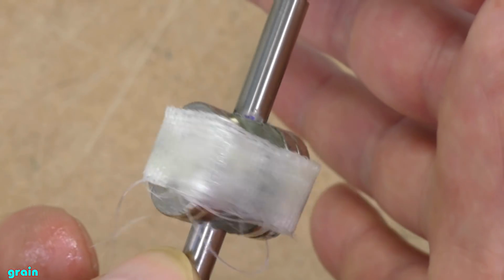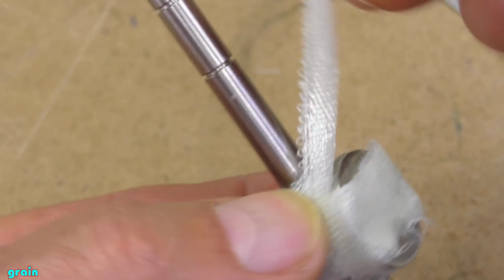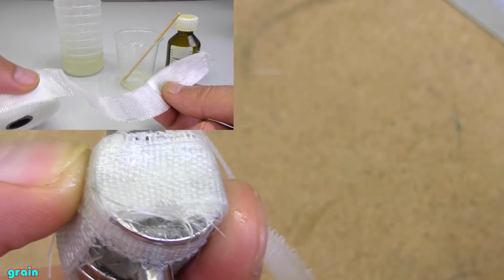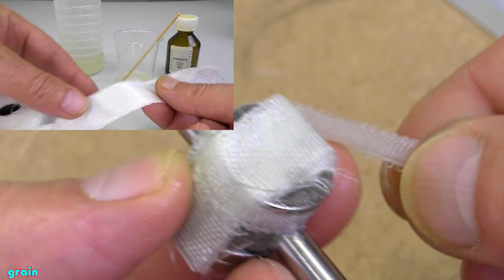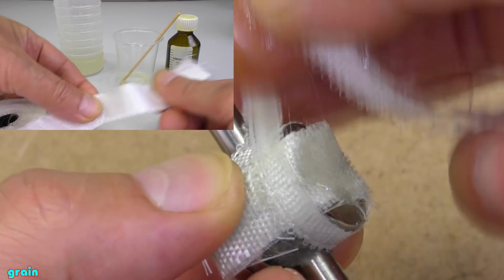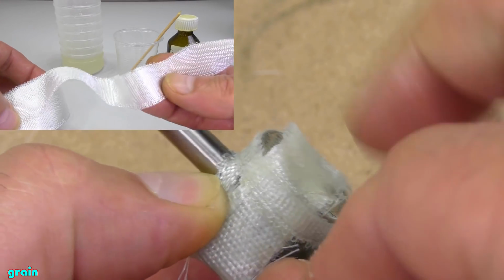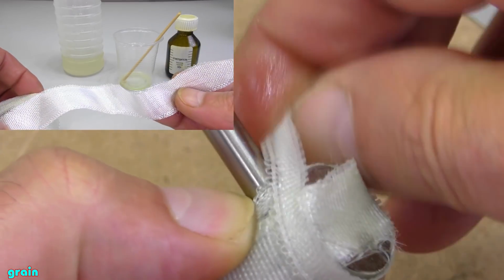If you want to repeat this project, be sure to wrap the magnets with 5-10 layers of thick fiberglass and soak it well with epoxy. Any other materials and adhesives will explode from the high RPM centrifugal force, magnets will fly away and may injure you.